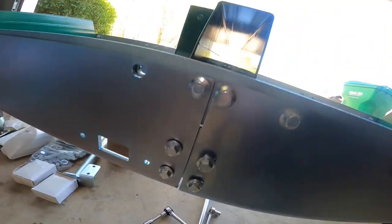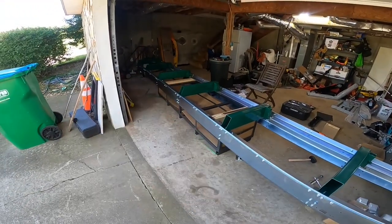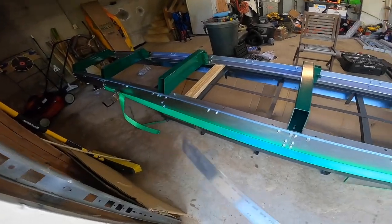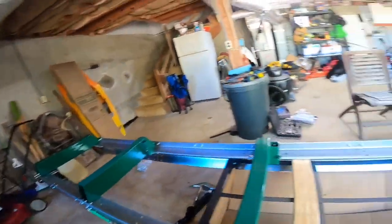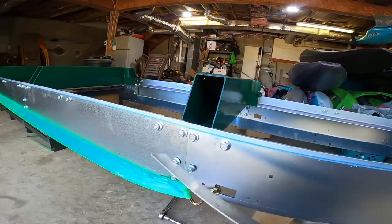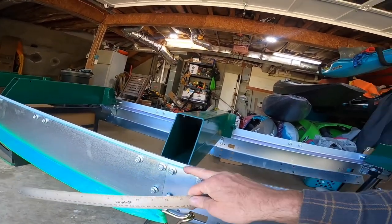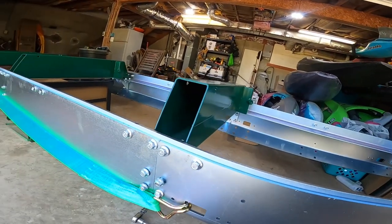These rails need to be the same height, just like we did for the long rails. We're going to get the long strap and connect it from end to end on the short rail - it's not long enough to reach all the way to the end so you go to the short side. We need to torque all these bolts down to 53 foot-pounds for the 10mm bolts. I need to make sure I have the same reveal across the rail and no gap. I've already got the two long rails in the middle on each side, so now I need to torque down the other three.